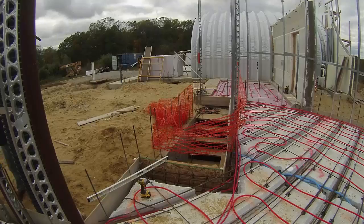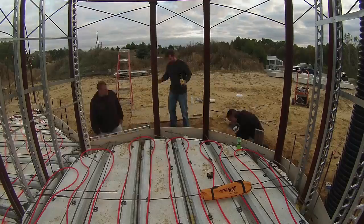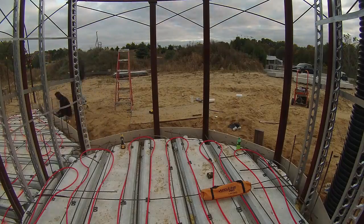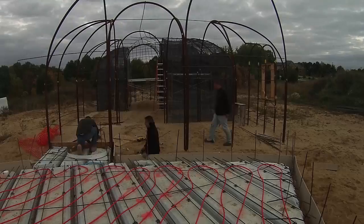As for the work, we were basically building a little perimeter wall to keep the concrete where it was supposed to be. We started with putting in stakes, then we put in the perimeter board roughly the right height, and then we raised the board to the exact right height and screwed it into the stakes to keep it in place.